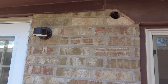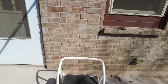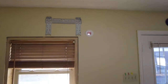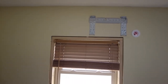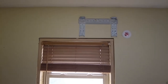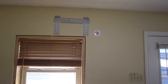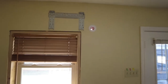Here you can see the hole I had to drill through the brick exterior - a two and a half inch hole. I'm basically going to run the line down the side of the window and then over to the unit. On the inside you can see I got the bracket mounted and leveled and the hole over there. If you notice, it's offset from the center of the window because above the window there's a header, and I did not want to drill that two and a half inch hole through the header.